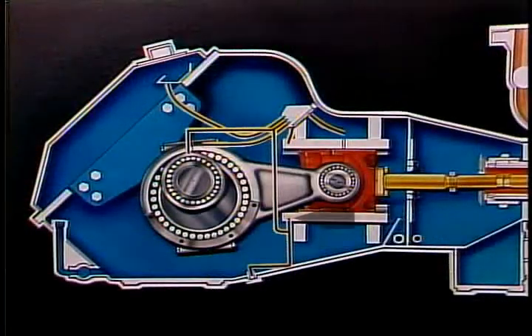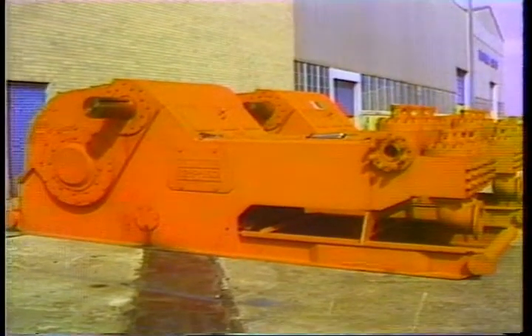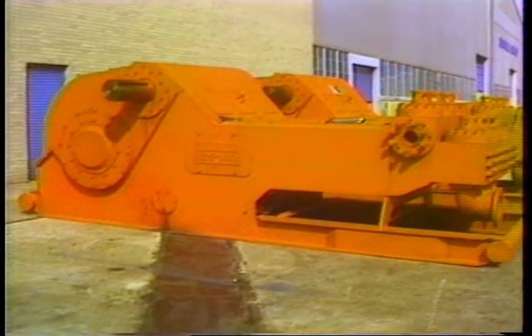The lubricant is piped to the lower crosshead guides and to a distributing trough, which supplies oil to the upper crosshead guides and crosshead pins, the pinion shaft bearings, the main crankshaft bearings, and the connecting rod bearings. Some pumps have no external oil pump or filter systems. These pumps rely on the main gear to carry lubricant up to a system of troughs which supply oil to the bearings and crossheads.